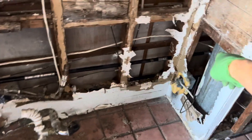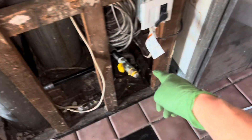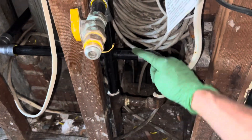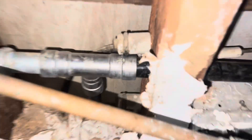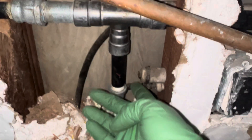All this had to be was one run of black pipe right to there, right into a fitting — they didn't need all this. Then you have your 90, your 90 — actually they didn't even need the 90. They could have gone 90 right here and dropped directly into this right there. How you get a leak on half a PSI or 1.5 PSI is beyond me. But this is definitely a fire hazard — you've got the pipe literally squished right up, smashing the cotton coating on the high voltage, tweaking and pushing the wire over.